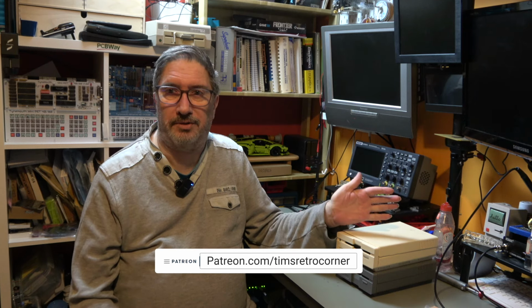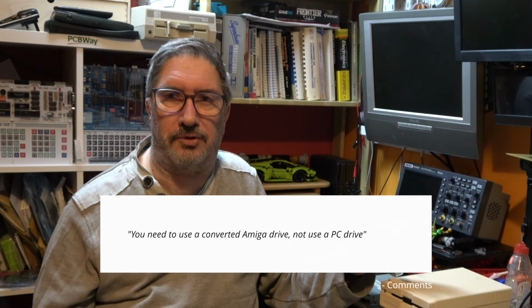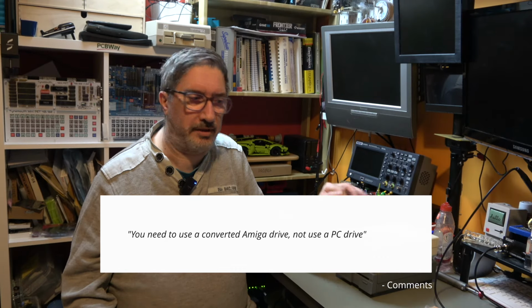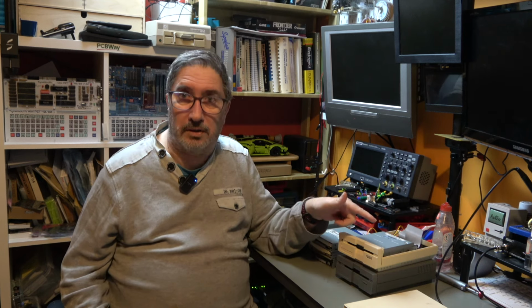From the comments to my previous video and from talking to other people and other YouTubers who have built drives like this, one thing seems to crop up time and time again, and that is you need to use a converted drive, converted to an Amiga drive, not use a PC drive. Also, it begs the question, if a converted drive works, why does the adapter board not work? Because surely the adapter board is doing the same thing that the conversion does. Or is it? We ought to find out.